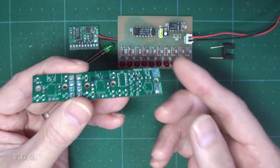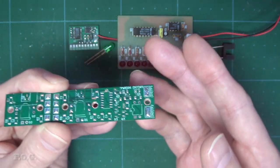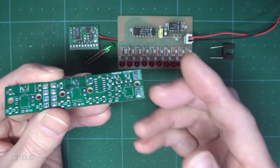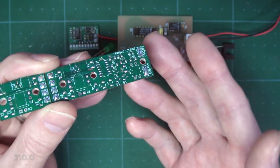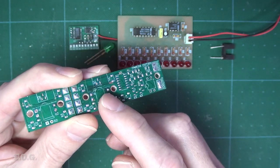So obviously the method for burning the slots in the resin and then embedding the white resin, you clearly can't use that in any place where it would bridge any of the traces. And naturally that's going to make it a pretty difficult process to use for these really tiny boards where we really don't have space to move around the text so it doesn't bridge any of those traces. Ultimately it means I'm going to have to come up with a new way to lay this text without burning slots into the resin.